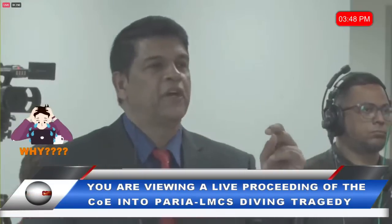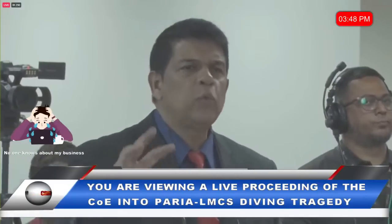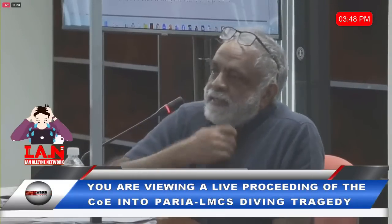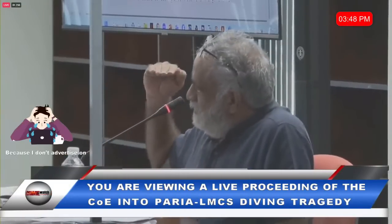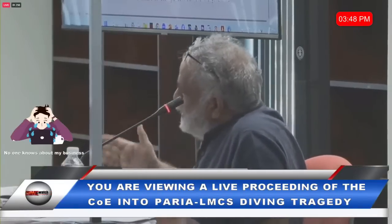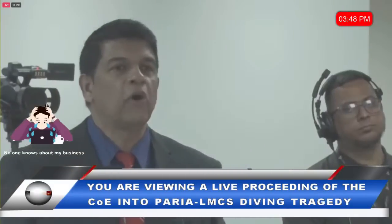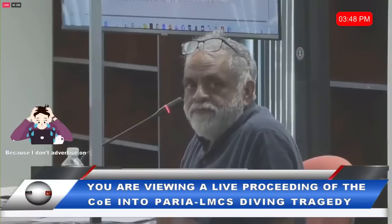Thank you so much. And that is why, Mr. Ali, you said something earlier, that it would have been worse if there was an opening at 5. Is that what you said? Tell us what you mean by that. This is not for checking the pressure now, Chief. If that riser was open and the plug moved, there would be no back pressure building up to stop the plug. So there was a greater likelihood of the plug moving away from where it was originally placed. Is that accurate? Correct. And that's it. Thank you so much, Mr. Chairman.